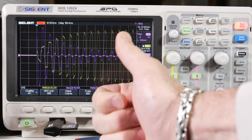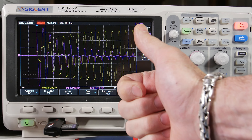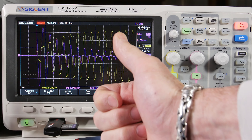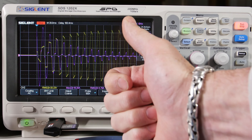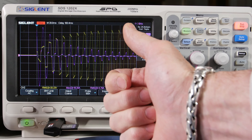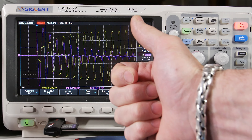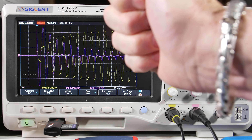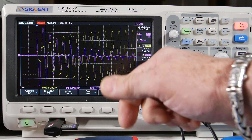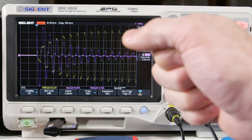Give me a thumbs up if you found that interesting. You can see now why the VA rating of the transformer has to be almost double the power output you want — because of the power factor. There's also distortion caused by the bridge rectifier and capacitors. We're going to see what we can do about that as we move forward. And we found that a thermistor will limit the inrush current, give more predictable performance, and reduce stress on our components and connectivity. See you next time.